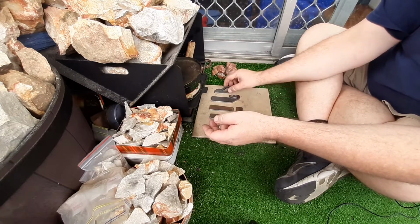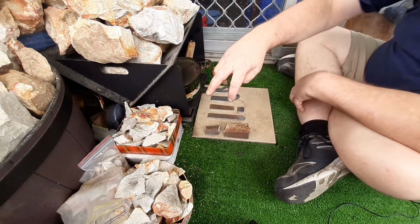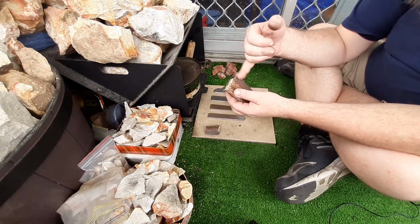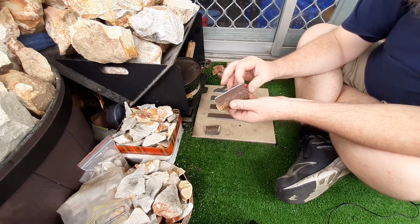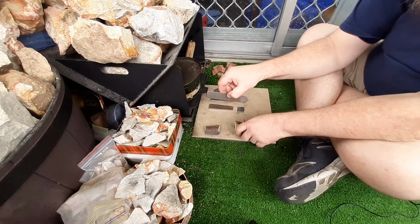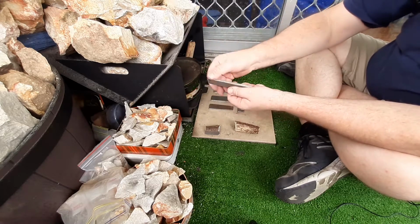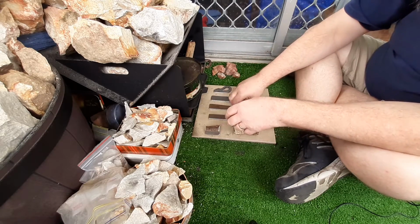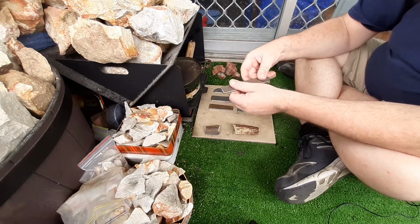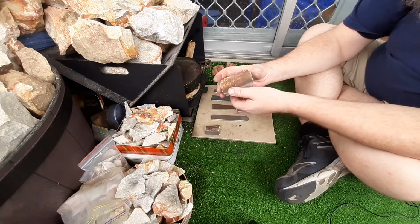So yeah, anyway, hope this has been a bit of an interesting and informative video. These are easy builds. They're not hard to do. Takes about 45 minutes. Just cut the channel, grind the striker to shape. Make sure you clean the face up. Make sure it doesn't have any file teeth marks on it, because all that'll do is chip your flints or quartzite out. And keep it cool. Do not change the hardness of this file, or it's not going to spark properly. Quite an easy build to do.